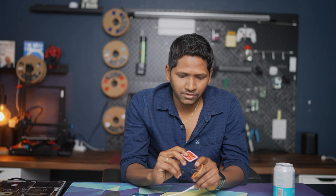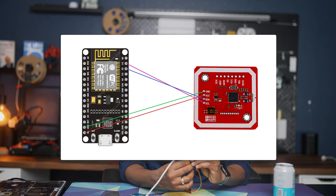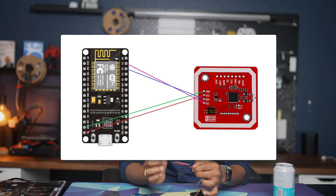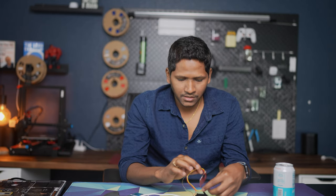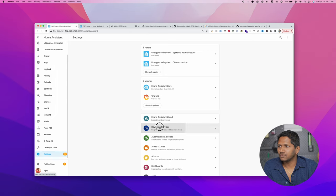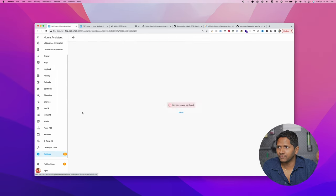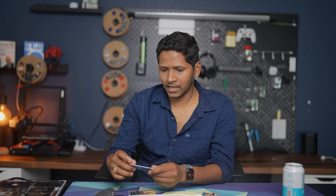I have connected 4 jumper wires to the RFID card reader. Ground goes to the ground on the ESP8266 board. The VCC pin goes to VIN. The SDA pin goes to D2 SCL D1. Once you have successfully connected, we are going to test this in the Home Assistant app. Go to the devices in the ESP Home and click the tagreader or the jukebox RFID in your case — you can see the device installed.